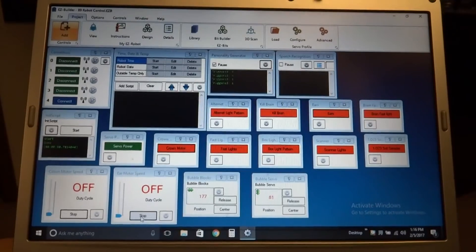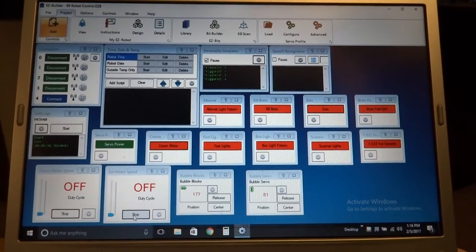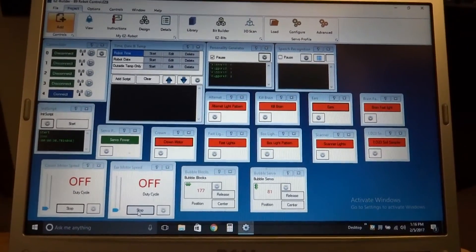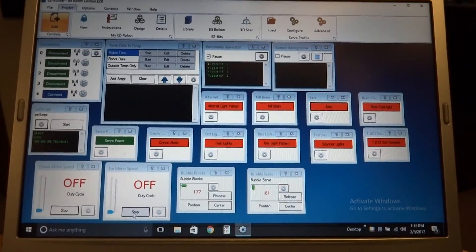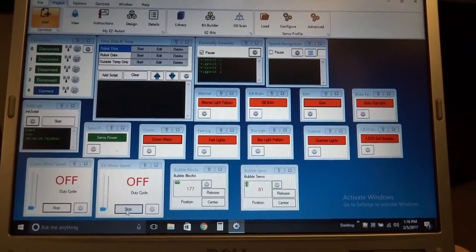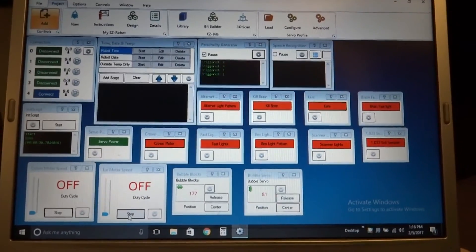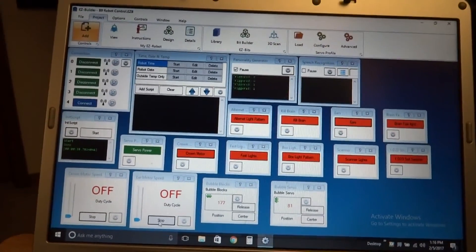One other thing I didn't mention before is that you can also use this method to brighten and dim LED bulbs. You can hook your LEDs up to the EZ-B and use this program to brighten or dim them. There are other ways to do it with PWM to control the brightness of an LED — Arduinos do it, and other motor controllers can do it too. Do a Google search and a YouTube search to find out what methods you can use to dim an LED with PWM. It's really the best way to go short of resistors.